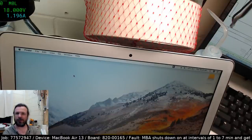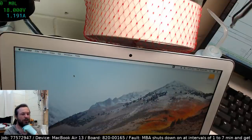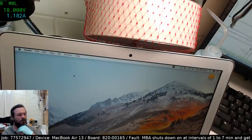Keep safe too. Just briefly to summarise what was done on this MacBook Air to fix it up and stop the powering off. There was predominantly a lot of attempting to provably make it fail, and we found that by just disconnecting the MagSafe that would cause it. We eliminated other variables by putting only the main board into a completely different chassis, and we found we could still make it fail. So at least at that point we knew that we were dealing with a main board fault.